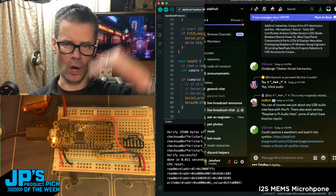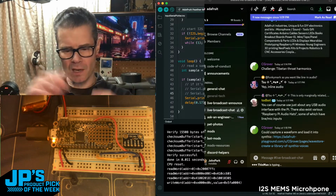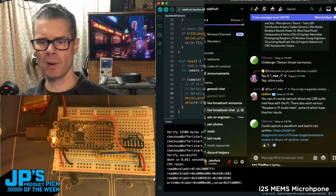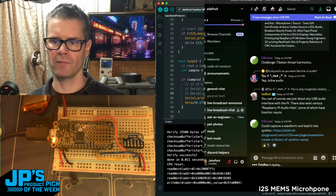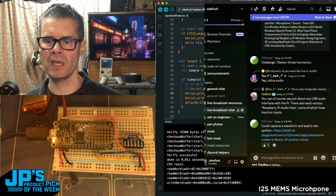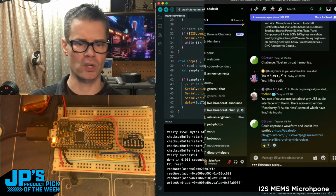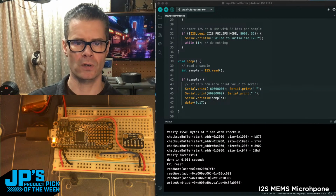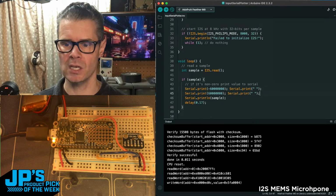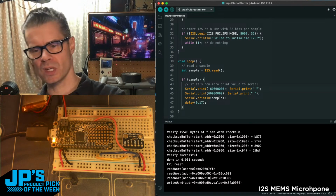serial plotter is auto-ranging on Y. So right now we're just seeing the frequency of a wave that's zipping by, changing, but the amplitude of it is also available if we force the plotter to not auto-range. So I'm going to switch over to Arduino here, and I'm just going to uncomment a couple lines. This isn't obvious from Arduino IDE 1 to 2.